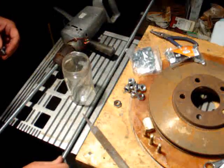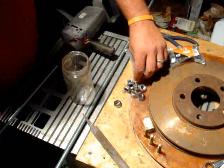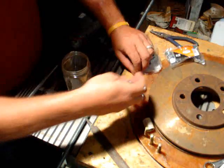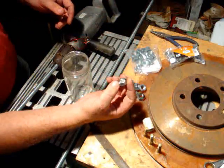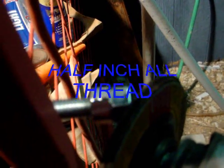I've got me some half-inch here. I wanted stainless steel but it's a little bit out of my range. The nuts are square like this, and with the half-inch, there's a little bit of slack inside the holes. So in order to keep it straight and centered, I had to taper some of the nuts — you can see how I ground them off here. Right here I have the drill with the half-inch all-thread, and I've got it double-nutted on the end and cinched against itself. Then, while that's spinning, I take my angle grinder at 45 degrees — a little less of an angle is probably better. It keeps them from coming loose but this will center it up in the holes.